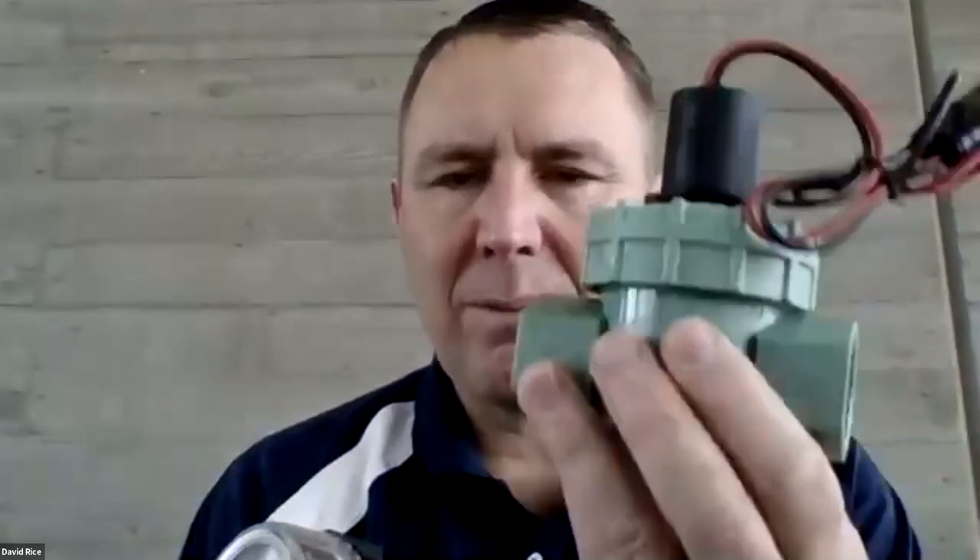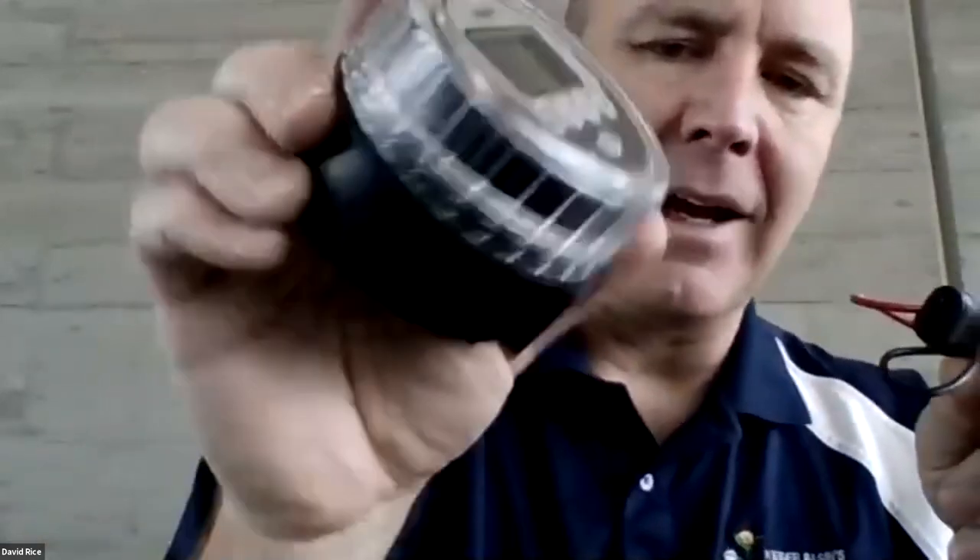In the event you need to add a valve somewhere but running wires is difficult, they do sell battery-operated valves. You still put it in its own valve box, but there's no wiring back to the main controller — it connects to a battery-operated timer. For example, if you're adding a vegetable garden and don't want to trench all the way back to the garage, if you have a hose spigot that's constantly live with pressure, you may not have to.